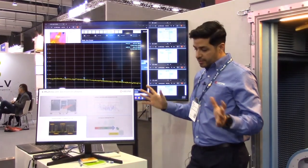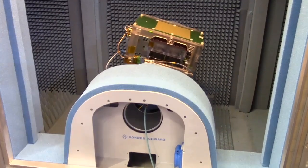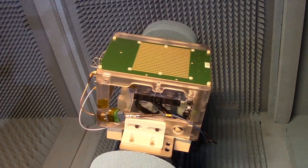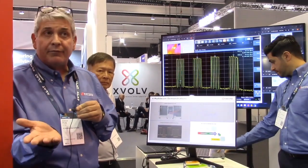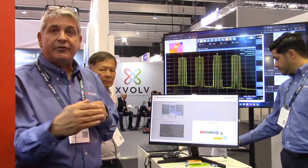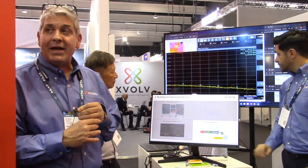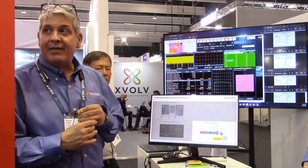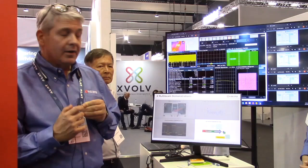For the last demonstration, we are going to merge all four beams into one strong beam and have one continuous 400 megahertz bandwidth. In all these demonstrations, we've been operating at 256 QAM. Most deployments in the U.S. for millimeter wave are operating at 64 QAM, but we've been asked to push this to 256 QAM — 8 bits per symbol. So when we're at 400 megahertz bandwidth per beam, that's 400 megahertz times 8 bits — 3.2 gigabits per second per beam. With 8 beams, that's 25.6 gigabits per second throughput through the antenna.